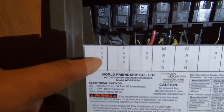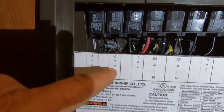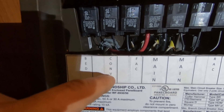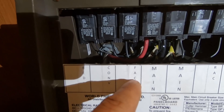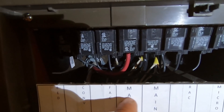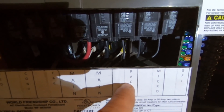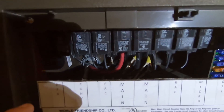The way this is set up, you have your bedroom outlets - there are two outlets - and your converter, which is your glorified battery charger, and that's going to be eliminated. Your front AC, then you have your two mains: this is your main for line one, this is your main for line two. Then you have your rear AC, microwave, and GFI.